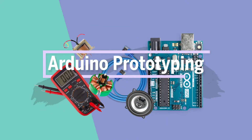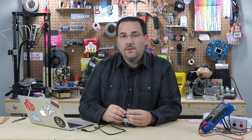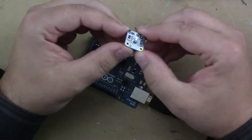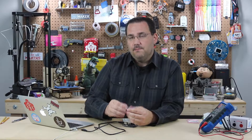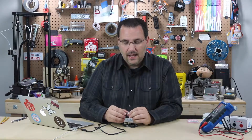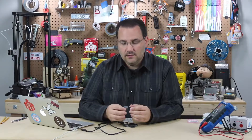Now let's take a look at another way we can measure light — specifically visible light and infrared light. This little sensor right here, the TSL2561, is able to do both of those. It can measure even light sources like infrared that the human eye can't see, and it's done very easily. It's also much more precise compared to something like a phototransistor. This sensor will output the total lux or luminosity it sees, both in the visible light and infrared spectrum.